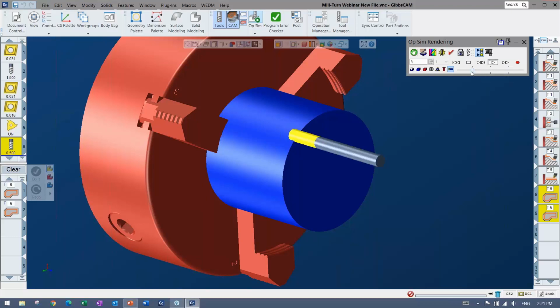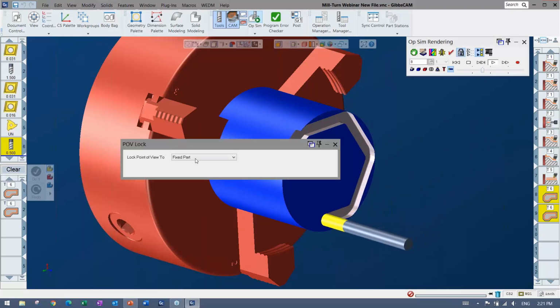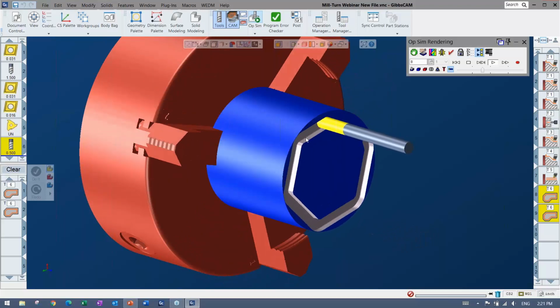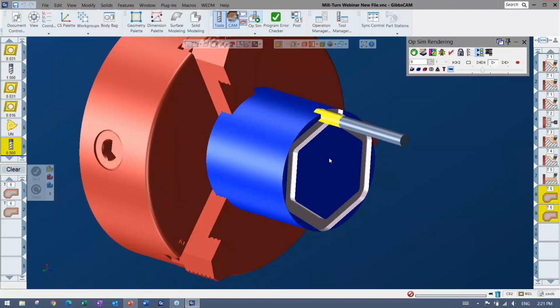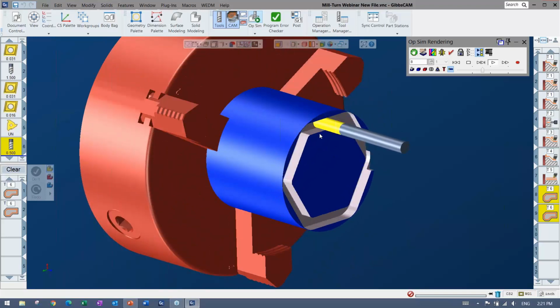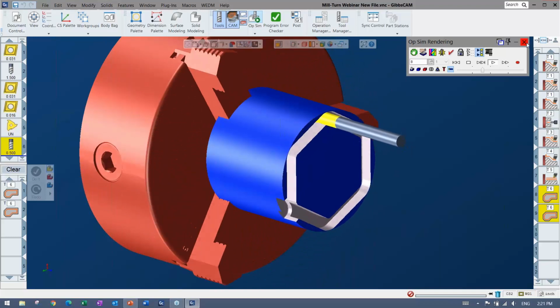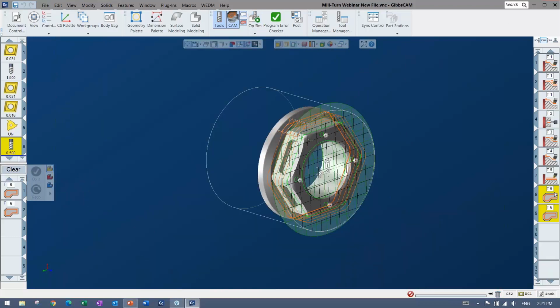And this is having to do with rotary milling. So this allows you to watch it as is if you want. All right, or I could go ahead and set it so that the machine is actually doing the motions it would do. Right, and you have this, which would be the C-axis interpolating, and you're doing more rotary milling or polar and cylindrical.